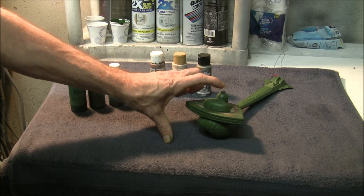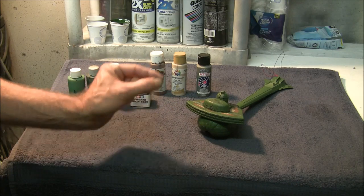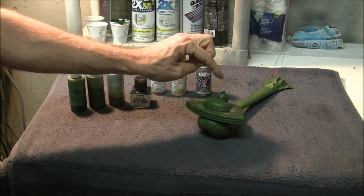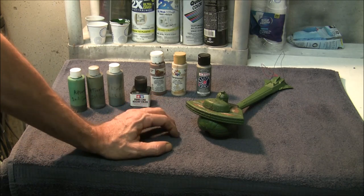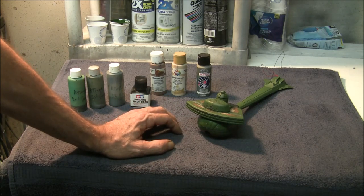Up here at the bridge, we just use a single 5mm red LED. As I said, there's a socket in the bottom of that part, and that LED is made to fit in there perfectly, so you just glue that in place. I didn't pre-paint the lens red either. I just used a regular red LED so that when you see it turned off, if you look at it really close, you won't see any red windows. It looks just black. And then when you turn it on, of course, you do see the red.